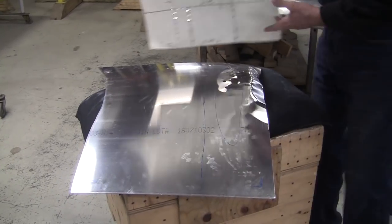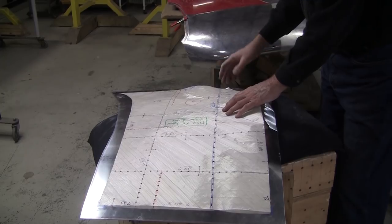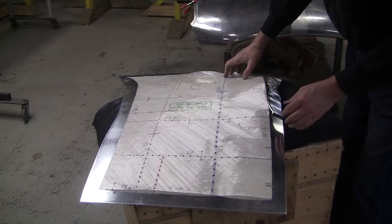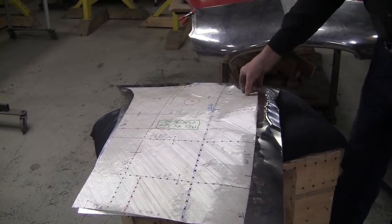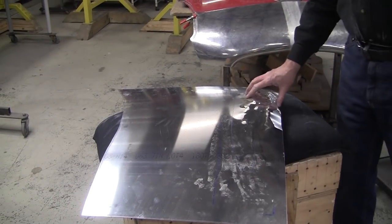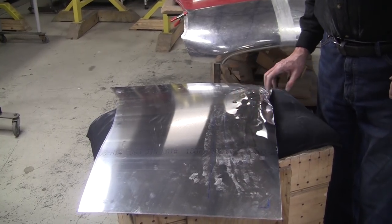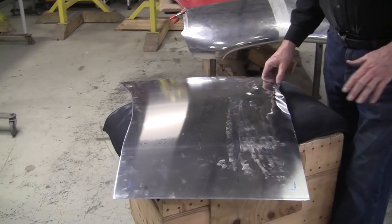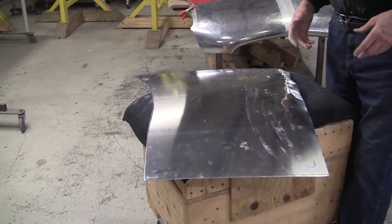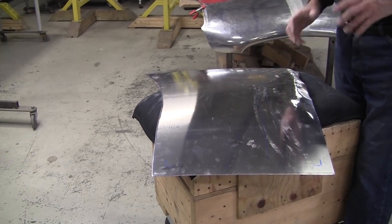And this would go a lot faster if I chose to anneal the metal too. But I can choose to anneal it, I can choose not to anneal it. Doesn't matter. Alright, so I'm getting close. What I'm going to do now is I'm going to wheel this smooth. Why am I going to do that? Because I want to settle this stuff all down. I'm reading highs and lows, which are the mountaintops and the little valleys here. And we'll get this all smoothed out in the wheel, and then we'll go another round on it. When we smooth it out, we also make it uniform again. We've upset the balance there.